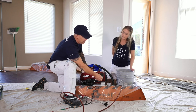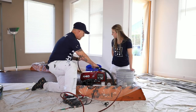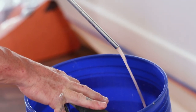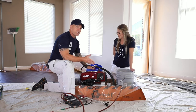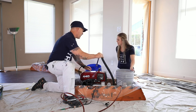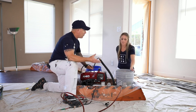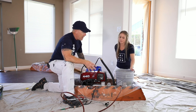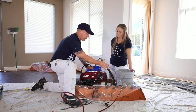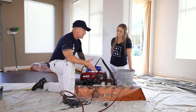It has an on-off button and a pressure button to adjust the pressure. I'm going to turn it on — you can see it's going to start sucking paint up through the intake tube and sending it out the prime tube. The orange stuff coming out was antifreeze that was in there. Now it's got water in it and it's ready to go. I have the paint in a five-gallon bucket so it won't easily spill, and everything is set up in an Outpac paint station for secondary containment so nothing gets on the floor. We also have drop cloths down.